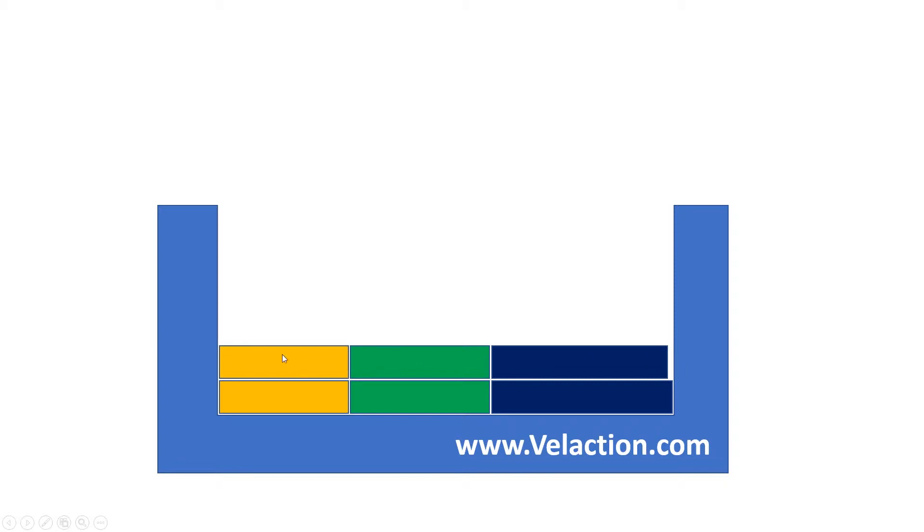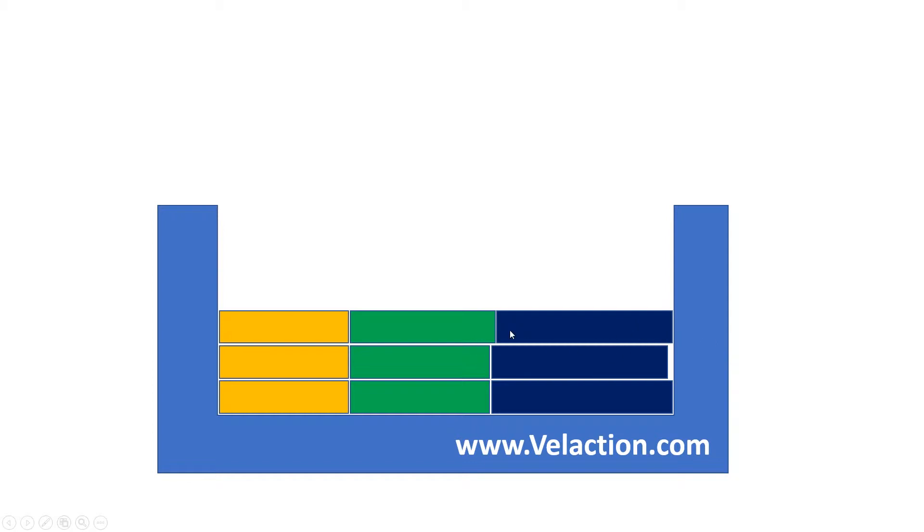And when you have many pieces together — three pieces or sometimes more — what you'll find is that often one piece will be a little shorter than normal and one piece will be a little longer than normal, and you'll still end up with a decent tolerance. This is basically a function of something called the central limit theorem. There's a standard deviation about how long each piece is, and when you put them all together, they all kind of form together to get their own normal distribution. Most of the results will fall within the middle of the spec range when you have three of them all stacked up like that.